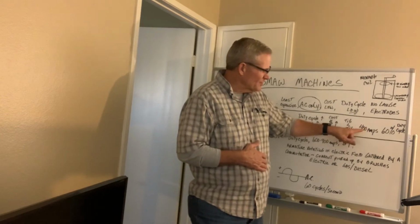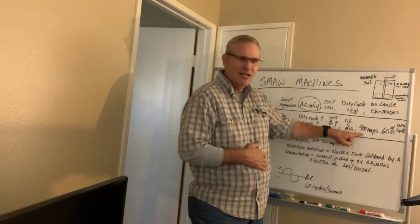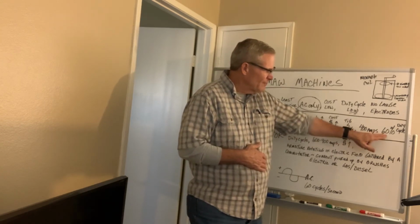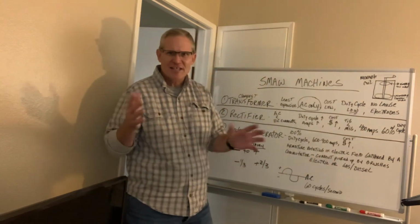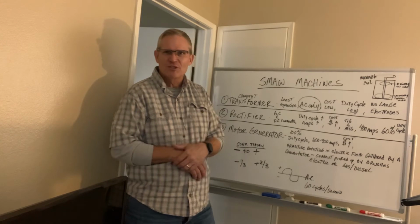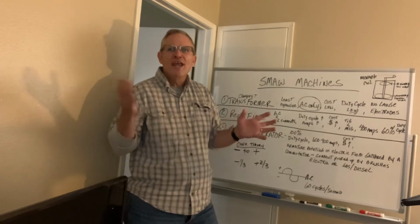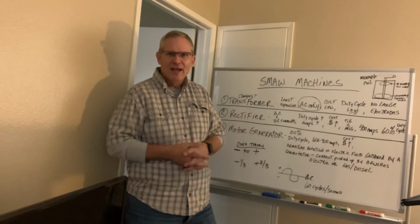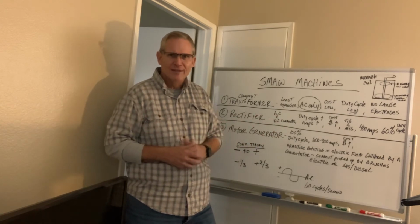Well, let's say I'm using the 1/8 inch 7018 electrode. So I'm only using 125 amps. And that brings this duty cycle into the 80s at least, 85% duty cycle. So I'm looking at 8.5 minutes out of 10. I will never reach the duty cycle where the machine stops working correctly.